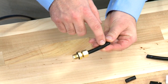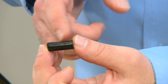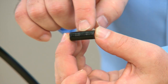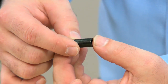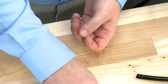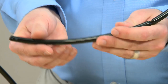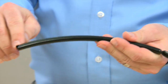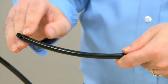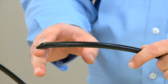As we move away from the valve connections, we need to continue to check our hose. Multiple connection points will show scoring in the hose, which is an opportunity for air to come into the system. We would want to trim this piece back and get to a clean piece of hose. When we trim, we want to make sure we have a nice square cut, as damage to the ends or cuts on an angle will not allow for the seals inside the fitting to be secure.